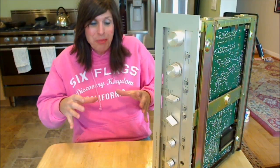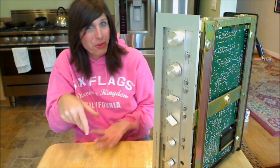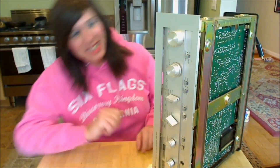Okay guys, I've got good news and bad news on the Yamaha CR620. The bad news first: I can't find my Variac — that big light blue thing with the dial on top that I can dial up from zero to 120 volts and put it through the system. The good news is I figured I just took a shot. I think I knew what the problem was and I think I fixed it. So I went ahead and pushed the power button. We've got a red light indicator on there, meaning we now have power to the unit. When I fiddle with the tuning knob, the meter jumps up and down getting various signal strengths. I think it really was that bad metal oxide resistor.